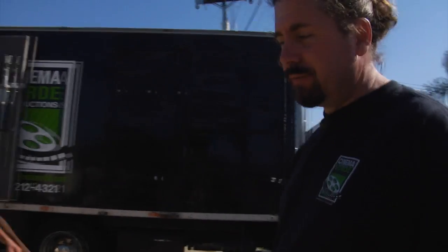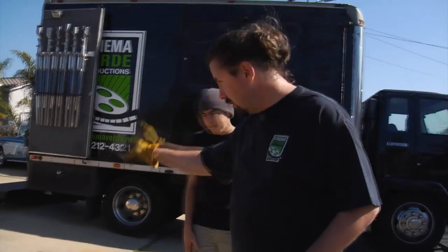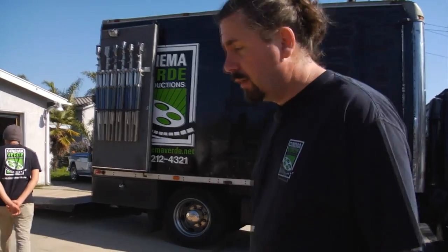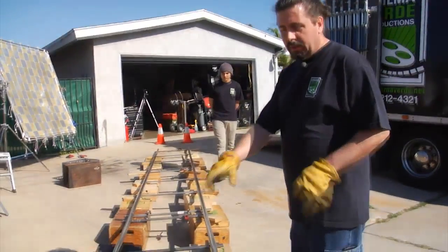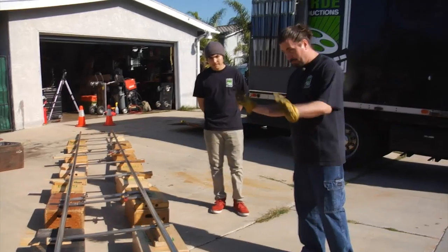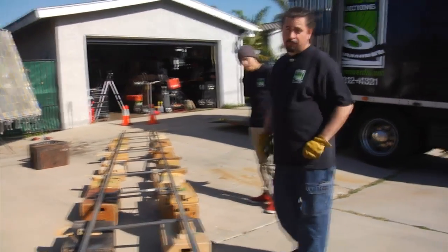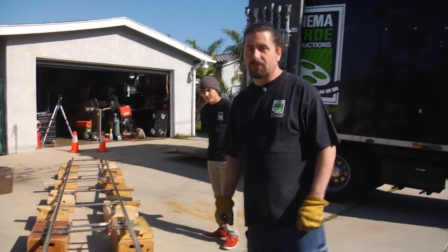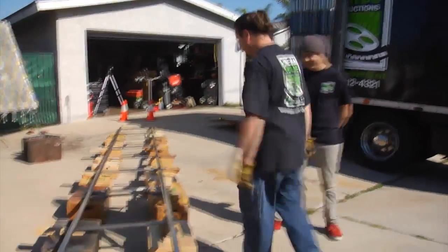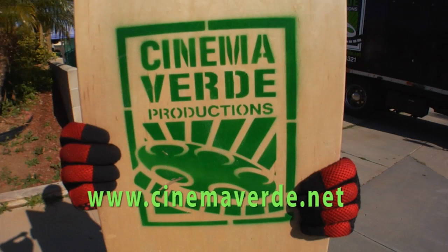You should be able to get through that relatively quickly if you have all the gear close. It's better if, after you rough it out, you actually get the wedges and dump them out along the length of the track along with the cribbing, so you're not making long trips back and forth to your crates. One guy deals with the level and holds the track at the right height; one assists him. The rest of the guys should be doing other things separate from this. When he gets all four points level all the way down, everybody can help fill if they all understand the process of not jamming it in and changing the level. Then get them to help you put the dolly on — and that's it.